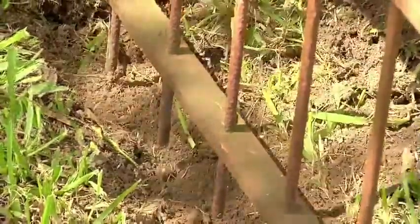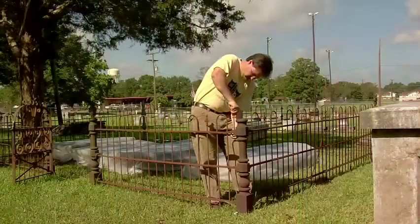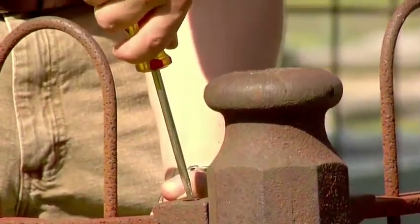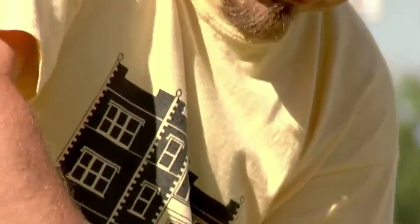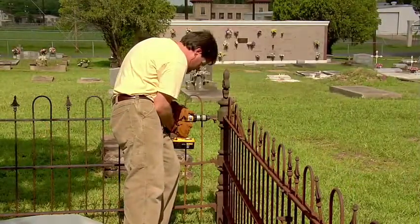Now that you've been paying particular attention to the fence, you may have noticed loose, disconnected, or broken connections. It is important to fix these so the fence will be properly supported. Tighten all loose bolts first — this may require the additional use of a lubricant. If any bolts are missing, these will need to be replaced. You may want to remove one of the original bolts to match the size and style for the replacement. Iron bolts are the best replacement, but stainless steel may also be used. Occasionally, bolts are broken off or rusted in the brackets. These will need to be carefully drilled out and the holes re-tapped to their original size, if possible.